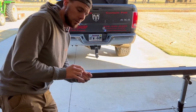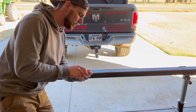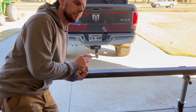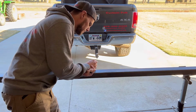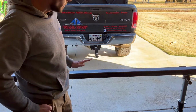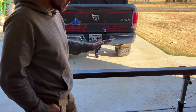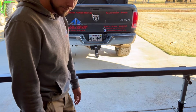As a fabricator, we're all the time fighting our welds. Our welds are all the time trying to move our material for us. And that's because of the heating and contraction of the steel. So the idea of heat straightening is using that process to our advantage this time. So what we'll do is heat up a small section, maybe a quarter or a half dollar size, on the long end of the tubing that's bent, or the long side of the arch. And as that heats and as it contracts, it should draw this back straight, according to the other internet people. So let's get the torch out and give it a shot.